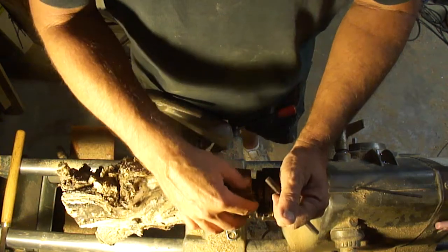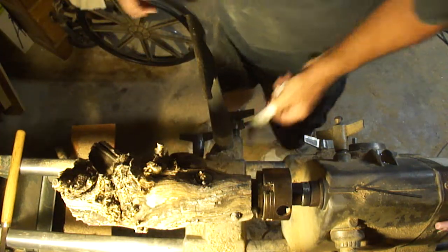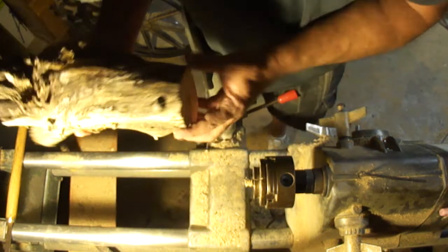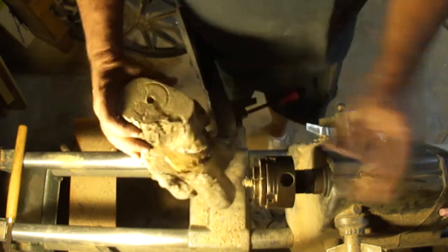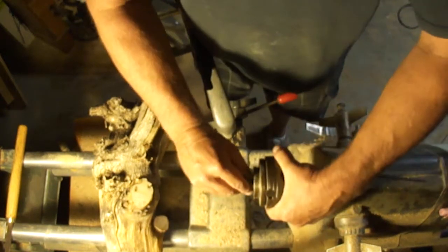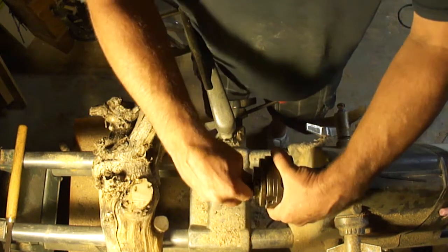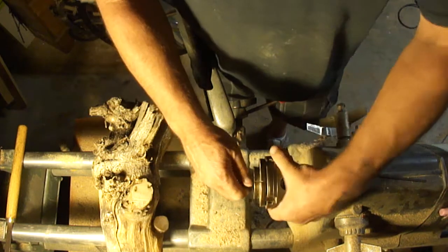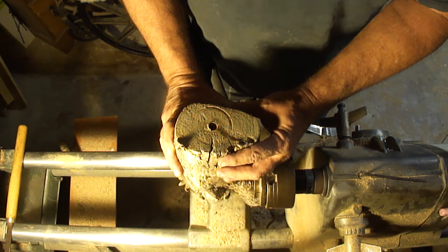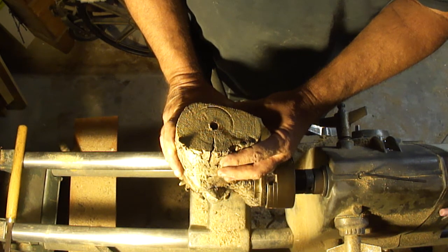Which I will also toughen up with some super glue. Let's see what happens when I apply the electricity. And that's what happens when I apply the electricity — you're going to have to think of something else. It just took the super glue right out of there. That's some really punky wood. That should have worked — worked really well with the last piece of Hackberry I did, and Hackberry is bad about coming off worm screws. I've gotten very fond of my faceplate lately. I think I'll try to at least get three screws of a faceplate on that, maybe four. I'll be back.